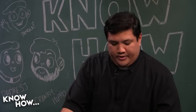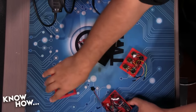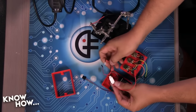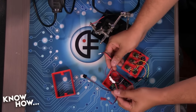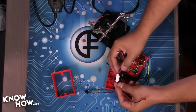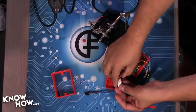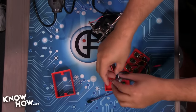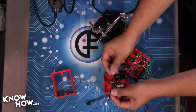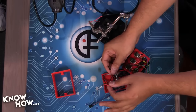All right, here we go. So what we need is this. This line right here is the line that's going to go to our Arduino. This is our little universal battery eliminator circuit. It's going to take 12 volts on this side. It feeds 12 volts via these two wires into our LED strip driver. It gets turned into 5 volts in the UBEC, and then I need 5 volts two places. This cable goes to my potentiometers. I need to provide parallel 5 volts to all the potentiometers in the circuit.